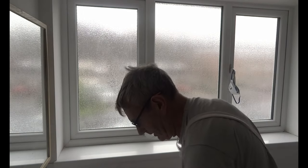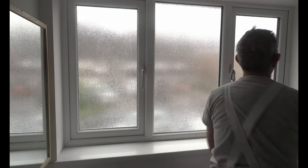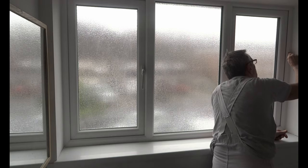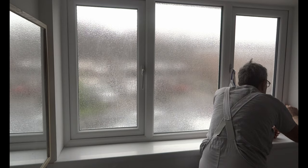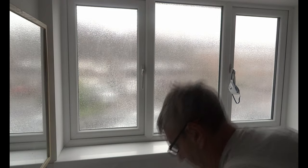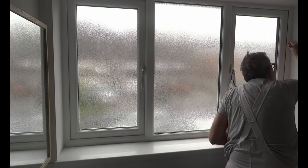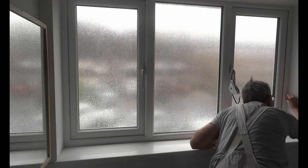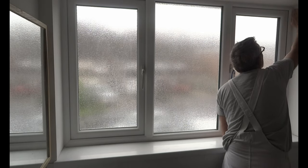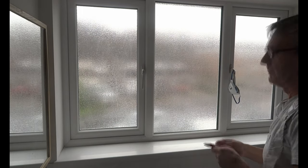Sometimes you have to rub it off early as you get too much build up, it goes up all over the wall. But always do this before you paint, because silicone will repel water-based paints. It goes all bubbly and horrible. Yeah, see in that one, I'll show you the opposite. I've got too much on that one. It's not a problem. I can just go down there and take it off that one. There we go, and we're down there. Like so. Lovely. Great. That's done.